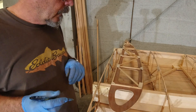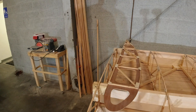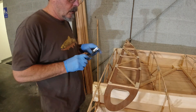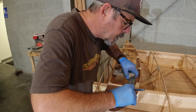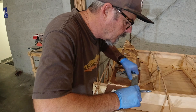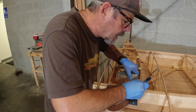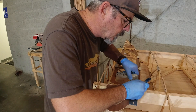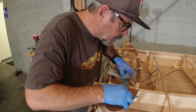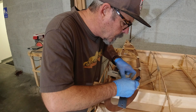I'll just mark that out. It's probably a little more than an eighth of an inch — that just has to do with the epoxy and stuff in between layers, it grows a little bit. I don't want to have to do it more than once if I don't have to, so I'm going to give myself just a little bit of a margin.